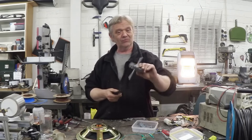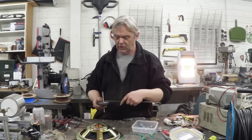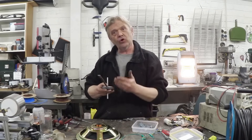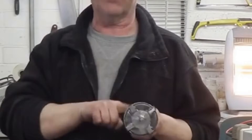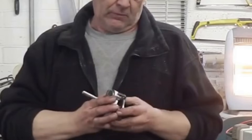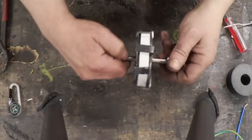And of course the magnet fits beautifully on there and is nice and centred, so we get our little rotor all centred up. Now what we need to do is put some L-brackets on here — we need 8 of them. The L-brackets I'm going to make out of 1cm steel, and they'll go on and bend over to cover the magnet — 4 a side, giving us 8 poles. All I've done to those magnet plates is weld on those little angle stubs. You can screw them on — I just like welding things. So I weld on those angle stubs, put the magnet back in, and we've twisted the field around so now we have north, south, north, south. And there's the rotor finished.